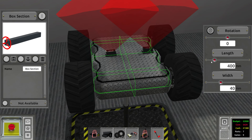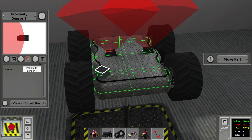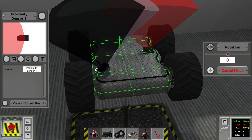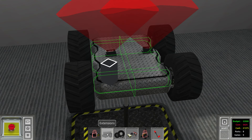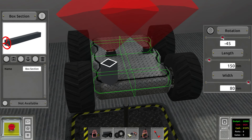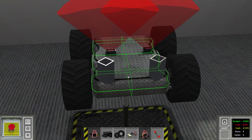Now let's check out the sensors. I'm actually gonna install two proximity sensors on either side, and we kind of have to make them face into a 45-degree angle. Let's place one here and see how that feels. We could place something here, make this really thick, and then rotate it by 45 degrees. Let's go up to maybe 150 millimeters and have it out as much as possible, orienting on this edge. And we need to do the same thing for the other side at minus 45 degrees.